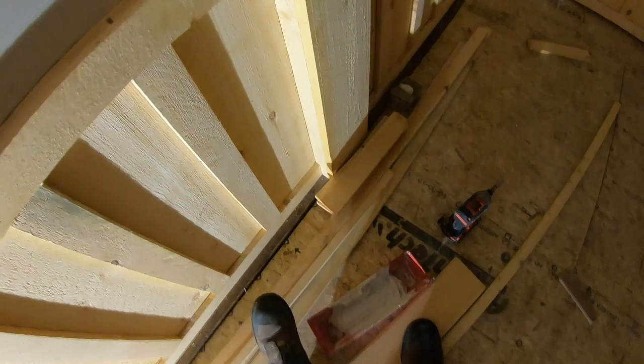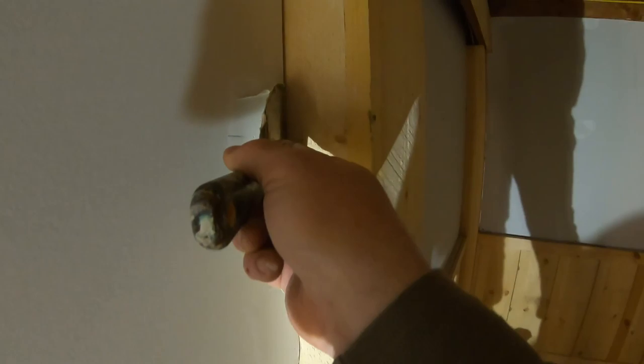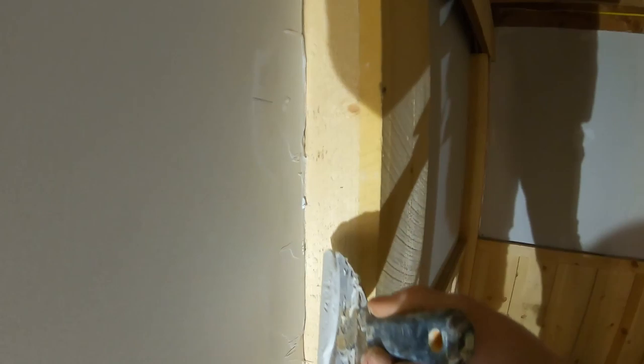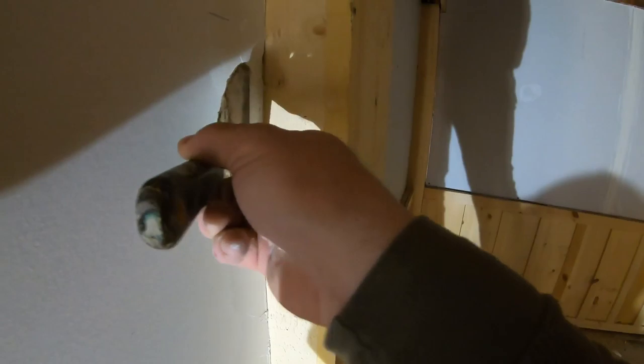When flat taping here, if you're really messy I suggest putting tape against the beam, even though you could wash it off. Backside of the knife — always scrape clean on your hawk so when you do this you're not getting mud on that beam. You want to tuck all your mud into that joint. If the mud was on the back of this trowel you're going to get it all on that beam. So tuck it all in, give it a nice healthy coat.